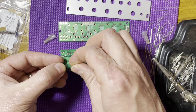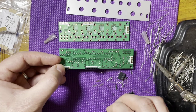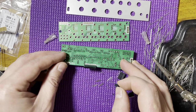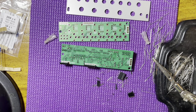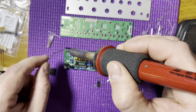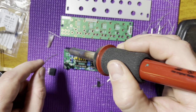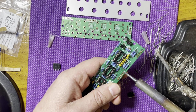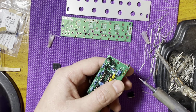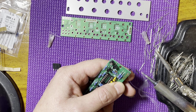After each cut, trim off a bit of the excess plastic. Now mount the headers on the PCB, on the opposite side to all the other components. Hold them in place and turn the board around. Solder just one pin for each header. Make sure they are on straight by reflowing the one pin you soldered while applying downward pressure with your finger. Do this with each header, then solder all the other pins.